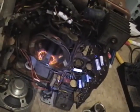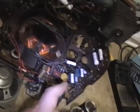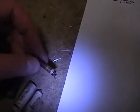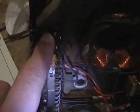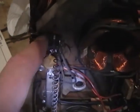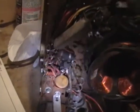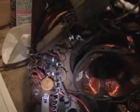With that picture tube out of the way, I've been making some pretty good progress replacing all the old capacitors and even some out-of-tolerance resistors, like this 47K that was measuring way out of spec. Also found a 330-ohm cathode bias resistor on the audio output tube that's measuring about 500. Replacing that should have a definite impact on the sound output.